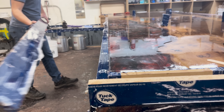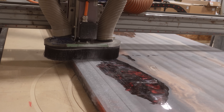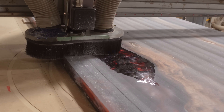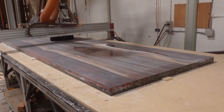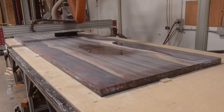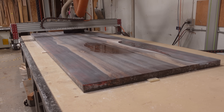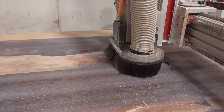After the piece has sat in the mold for seven days and we've got it demolded, it's back downstairs onto our CNC machine to remove that excess layer of resin from the surface. We purposely pour this extra layer of resin on top to try and fill in all the cracks and voids in a single shot. It ends up being much more cost effective for us to do it this way instead of taking the extra time and labor to individually fill all those voids.